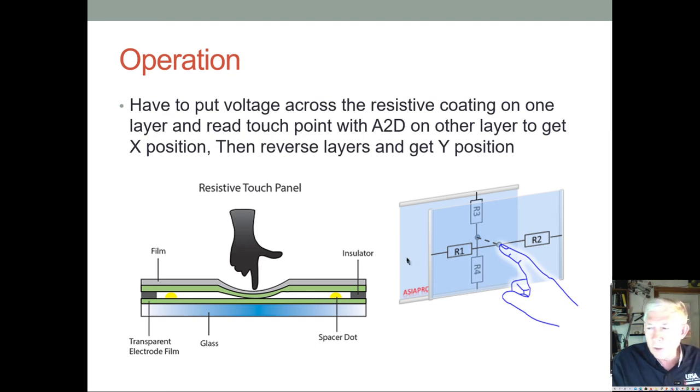All right, so that gives you a little bit of an idea how the touch panel works, and once we get that information, then we know where the ball is. And if we can compare it with some previous information, we know how fast the ball is moving on each axis, and so we can use that information, the first order and second order information, to drive our PID controller. So we have a proportional input based on just where the ball is, but we have a differential input based on how fast it's moving.